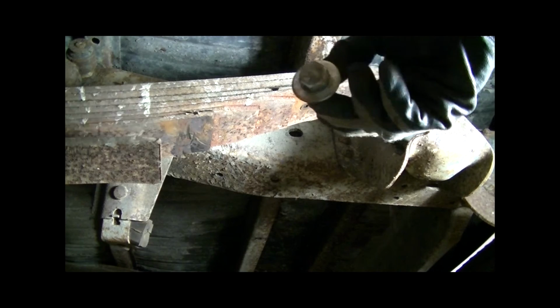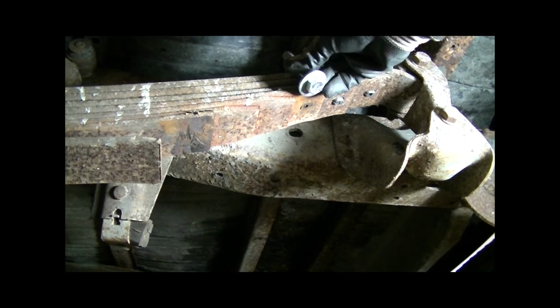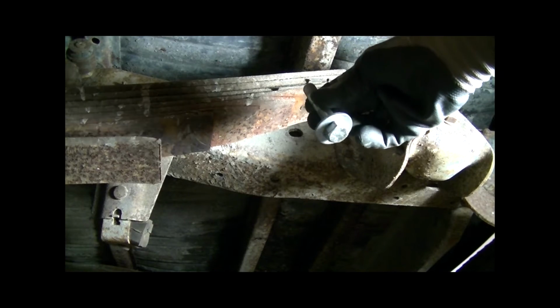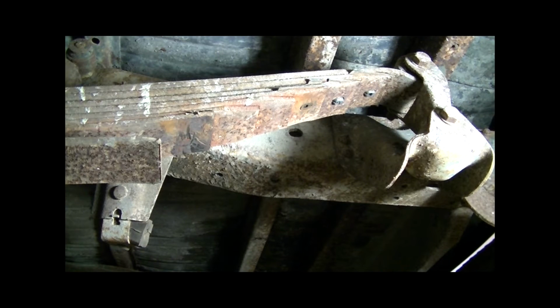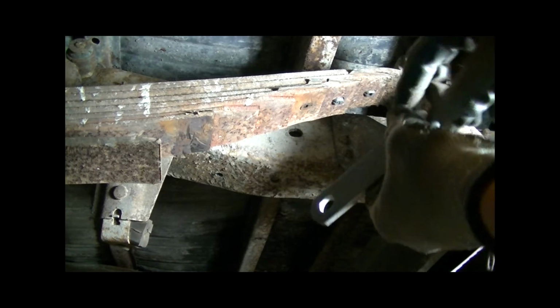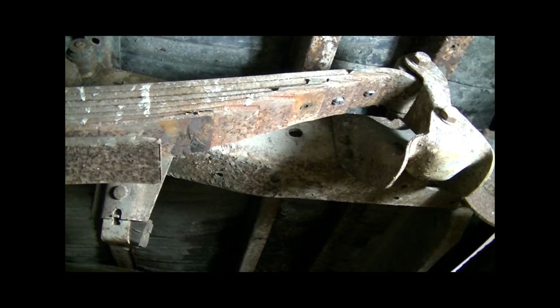Now when it comes to mounting all this, I like to have the threads point up. I figure it's one less thing to potentially get caught on another vehicle or on something else on the track, so I put the threads facing upwards and out of the way. Some people maybe are different, but I like to do that. I have not had any problems with it since. So what you want to do is grab your bolts, and I also have a nice big washer underneath each head here. I'm going to drop them in. So I got it like this, alright? Now the bracket's ready to go.